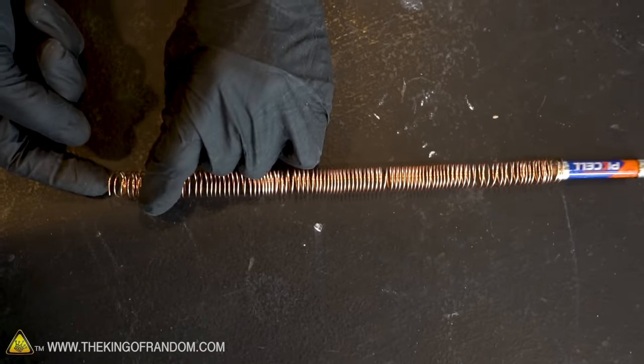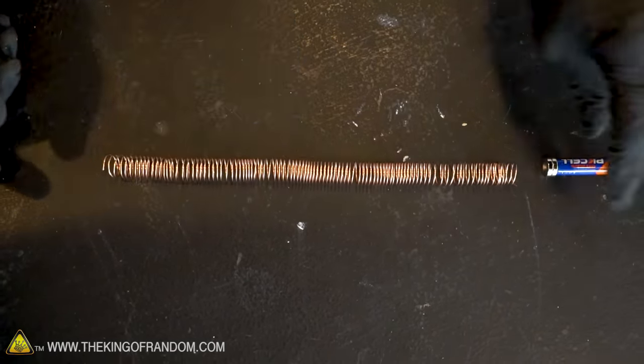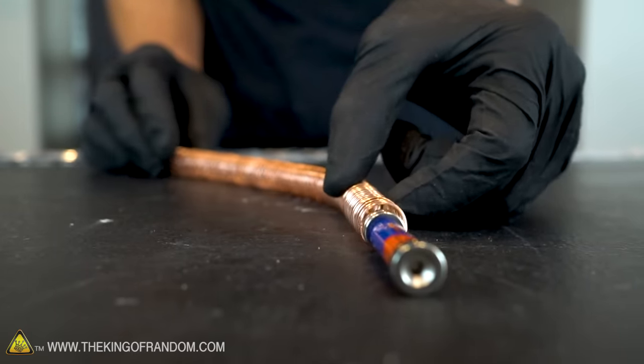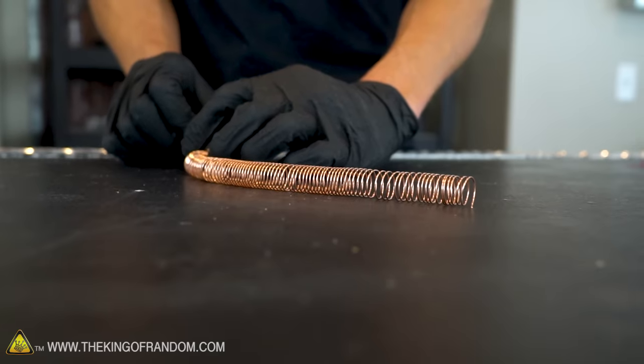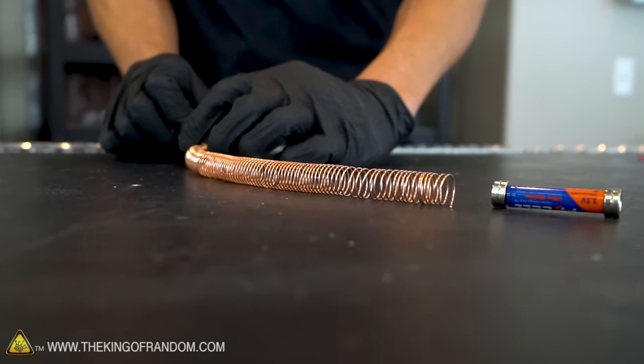Okay, so what is happening as our little train goes through its little tunnel? When the magnets make contact with the copper coil, electricity is running through them and through the copper. As we know, electricity running through the metal wire turns it into a magnet. Because we have our magnets facing opposite directions, the magnet of the coil is pulling on one side and pushing on the other, running it through like a train.